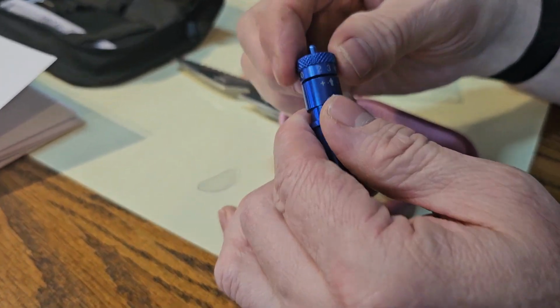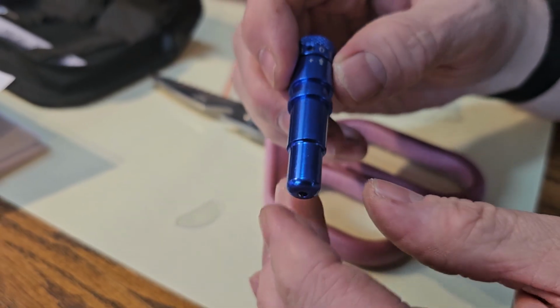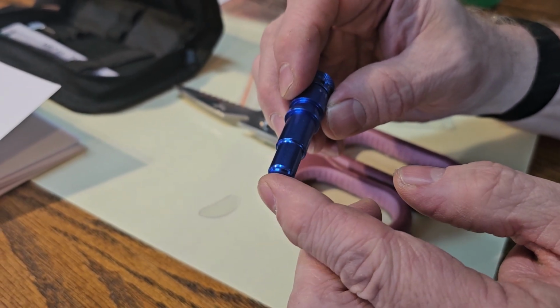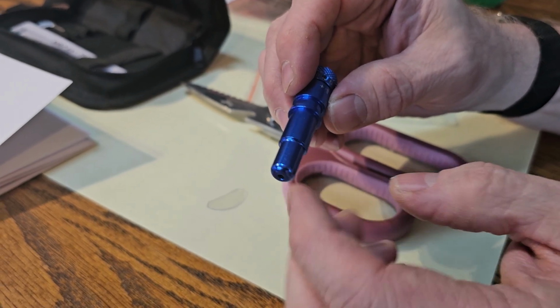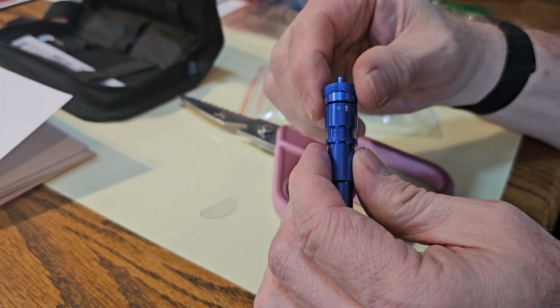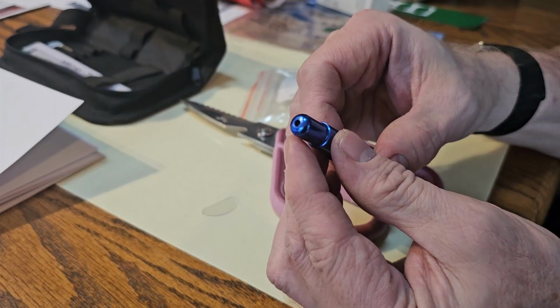And then this is the adjustment wheel that you have on this. So obviously you want to set that to 0, and I'll show you how to set that in a second. But if you just run your finger over this, it's not going to be hardly anything. It's barely sticking out. And what we found is about 2 or 3 seems to be the best cutting depth.